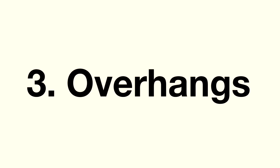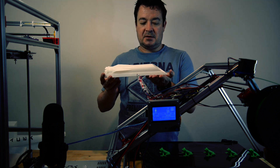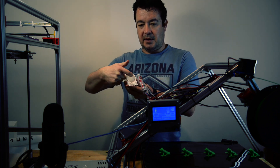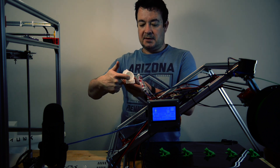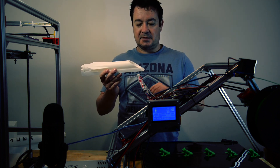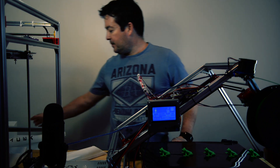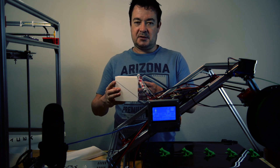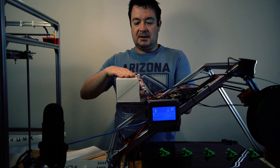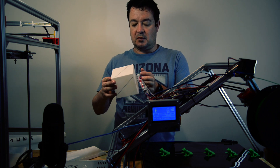The third reason to use a tilted belt printer is actually my favorite and the most interesting. If you have a look at this partially printed SpaceX rocket, when you print this on a normal printer you would not be able to print the top layer without support — you would need support on the inside of the model. This allows you to print some very interesting things where normally you would need support, but you don't need support when you can overhang like that. So this cube was printed standing up, and I did not need any support on the inside to print the top layer — it can just print without any support.